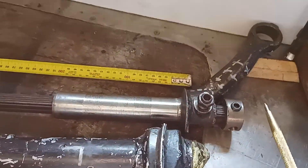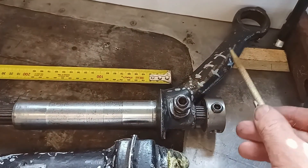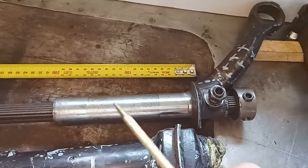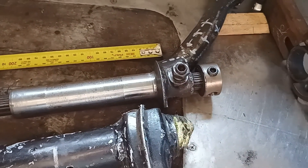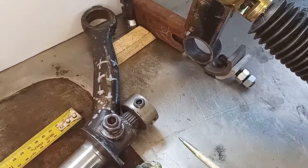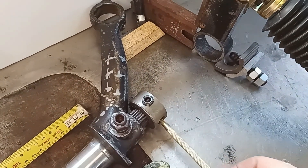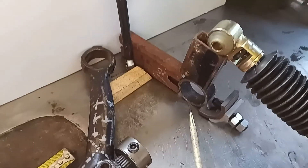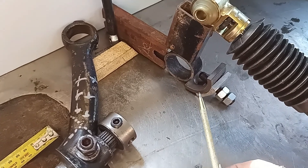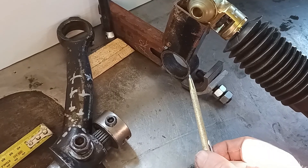What I intend to do is to use all of that unit but effectively chop the arm off, so I'm only using the part of the arm that serves to locate in the bearings. That will then have an additional eye on it, which is actually a Volkswagen height adjuster that feeds into the bell crank through that tube. It can be ratcheted round to various preload angles because the height adjuster is welded into the locating tube.